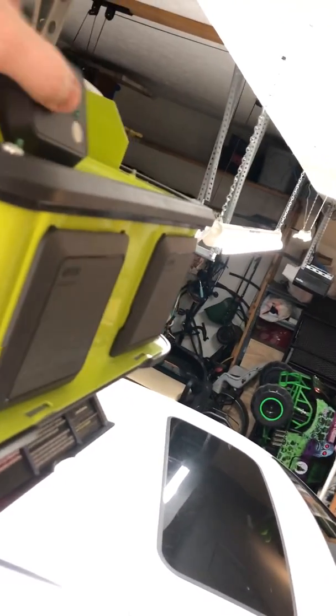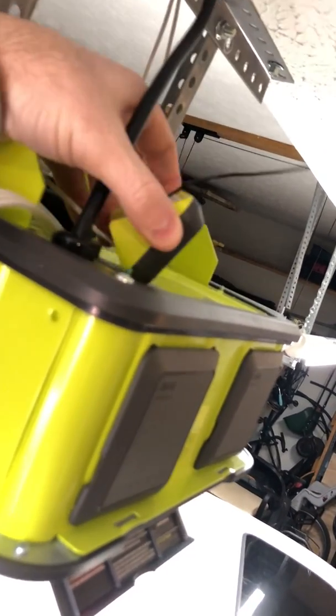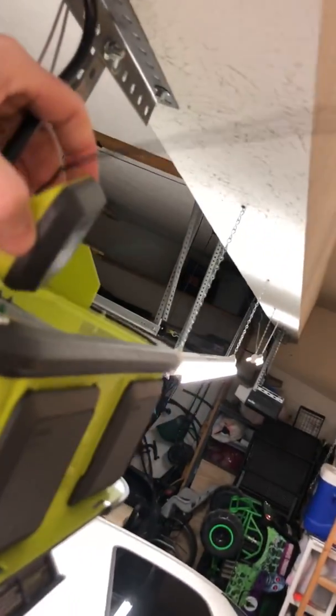So there's 2 options. One is you open up the box, and there's a wire. This black wire is coiled up inside the box. That's the antenna that receives it. So all I did was uncoil that. I drilled a hole in the back. I don't know how well you can see it. It's not focused very well, but drill a hole in the back, pull it out, and straighten it out. Get it as long as you can. That seems to work for me.